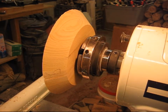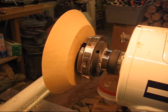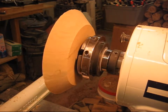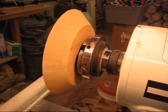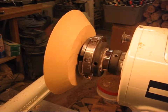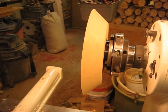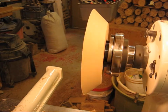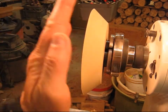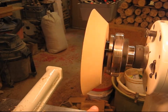I've now mounted this faceplate — or this bottom ring — on the lathe. I'm going to turn it on to see how true it's spinning. The jumbo jaws we used to turn the inset out are not as true as they could be, and you can see there's a slight wobble. I'll pull the camera over a little bit further. Speeding it up, you'll see it much more pronounced — it's moving a bit side to side.